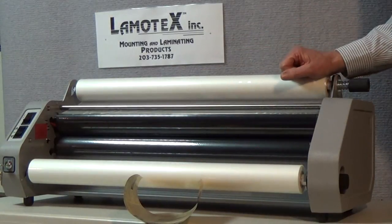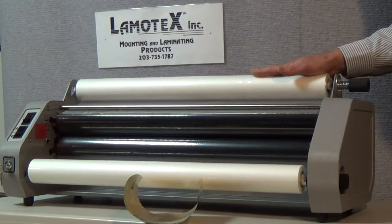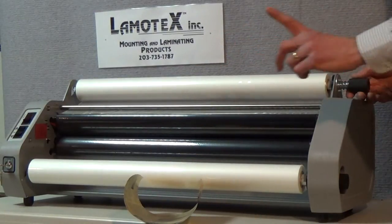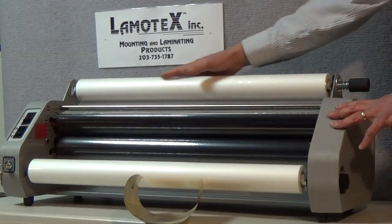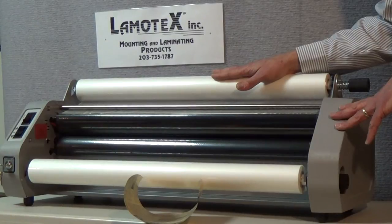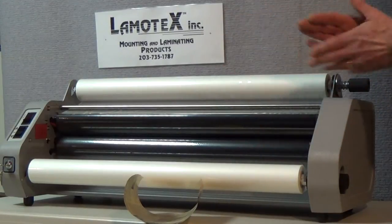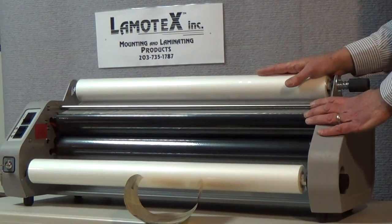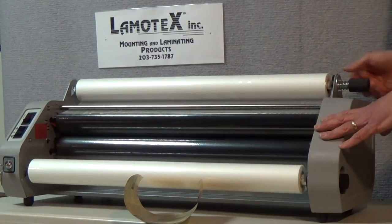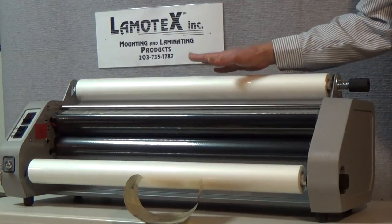How do we adjust for this? Well this can easily be adjusted by releasing or removing tension on the top shoe. Here we have far more tension on the top than the bottom and since rule number one says use as little as possible, we're going to eliminate or reduce the amount of tension we have on the top roll of film. Another way of eliminating this wrinkle is to apply more tension to the bottom, but again that flies in the face of rule number one and is only going to yield more wear and tear on the machine. So in order to avoid this type of situation we're going to equalize the tension simply by relieving tension on the top of the roll.